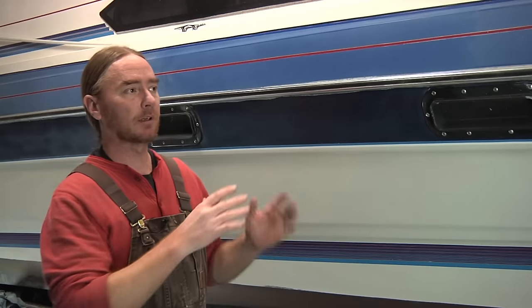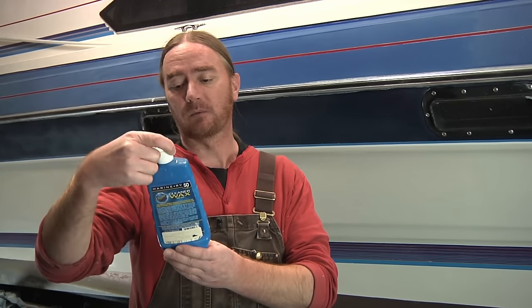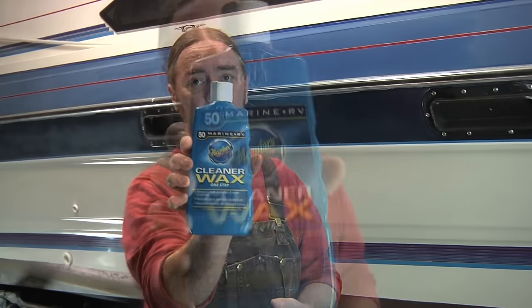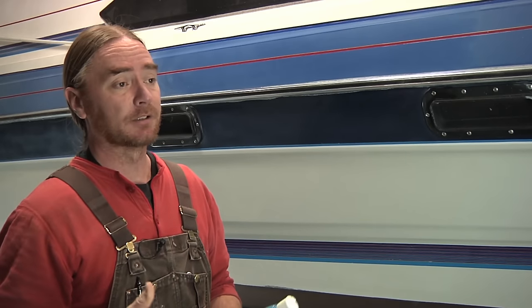Once you've gotten the surface clean, you need to figure out what's going to be the next step. As a general rule, you always want to approach a gel-coated surface or even a painted surface and try to sort out what's going to be the least invasive step that's going to give you the end result you're looking for. If the gel coat has been maintained properly over the years, really all you'll need to do is go over with what's called a one-step or a cleaner wax. I tend to use Meguiar's stuff — it's their number 50, their cleaner wax. It works very well, it's easy to apply, easy to take off, and it just works.